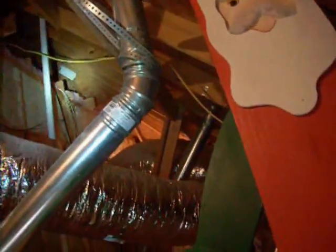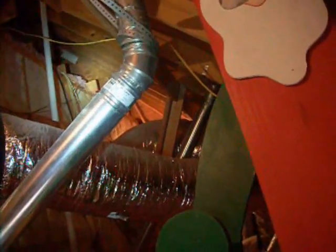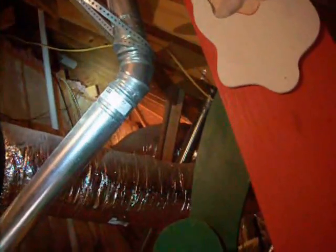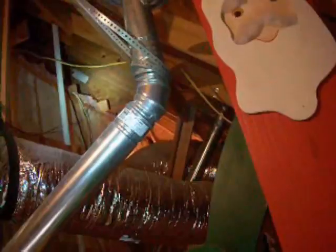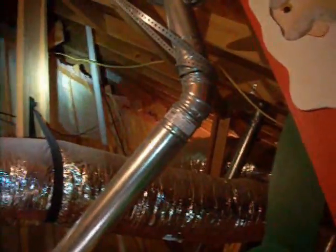Now, you're not going to go there, I know, but all it requires is you've got access, and by putting that simple ladder in, which you can do with 2x4, buy yourself an 8 foot of 2x4, maybe a bit longer, measure it up, and then you can put in a number of rungs that allow somebody to climb up and then get onto the top of those joists there, that would then allow them to cross over to the attic on the other side.